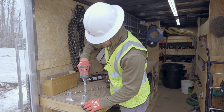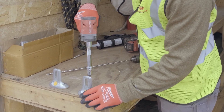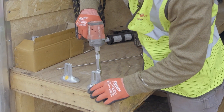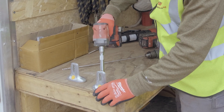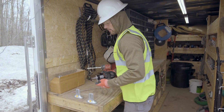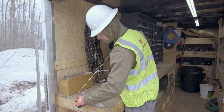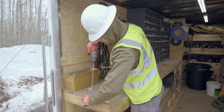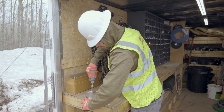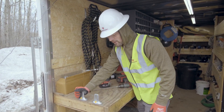We take it and sink it down deep. This would be the uphill side, so if you were looking at the roof this little grommet is on the uphill side. We take our leg, find the hole, and sink it down. It is nice and tight — you could probably park an elephant on that and it's not going to move. We need at least two in a series so we can cross the rail on both of them and secure it well. She is snug as a bug in a rug — that's not going anywhere.